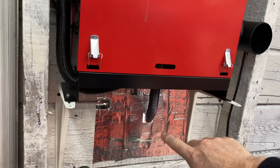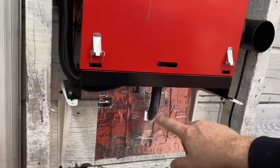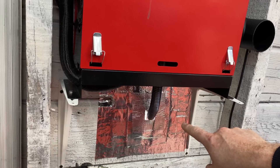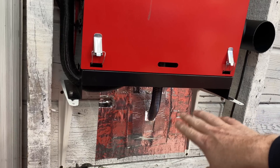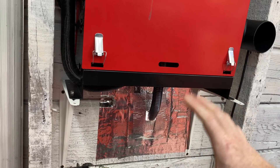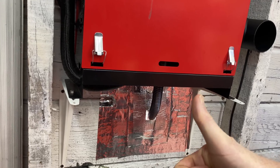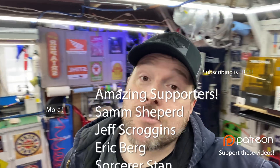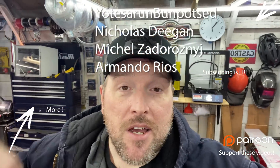I'm not going to get into the exhaust details because I don't want to be responsible for your setup. But what I did is I increased the hole size — it's suspended in steel and aluminum, then I use high-temp exhaust tape and aluminized tape around that. So I've got a huge area before the wood and I've had no problems. This has been running for a couple of weeks now. I really hope that was helpful — it's a wonderful diesel heater, I should have put it in this shop much sooner. We have the makerspace fully functional now; I can fab just about anything out here. Join me for more of these videos, good luck in all your electronics projects, and links will be down below for all the stuff you need.